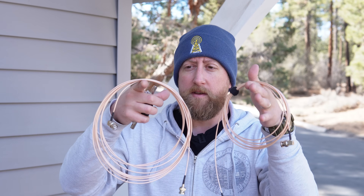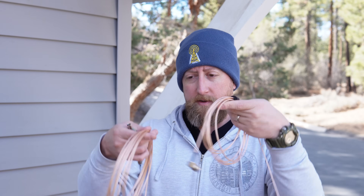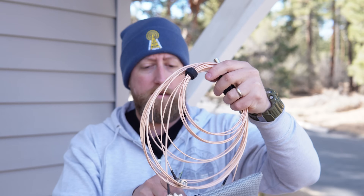For feed line, I picked up this RG316 coax along with the Packtenna one-to-one choke balun. This goes in between the coax and then into my radio and up to the feed line. I don't think anyone would tell you that RG316 is low loss coax, but it's highly packable. Here's my antenna bag, which also has a roll-up J-pole in it — nice flat pack. Goes up against the bottom of a pack or up against your back. The Tactical Mini goes into a water bottle holder. That's pretty much all there is to it for this antenna system.